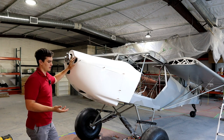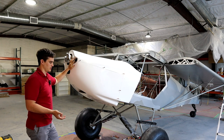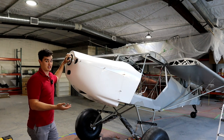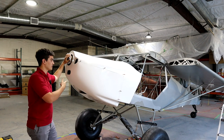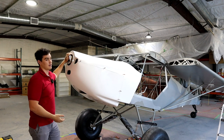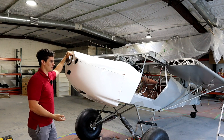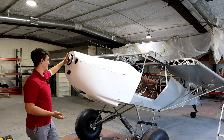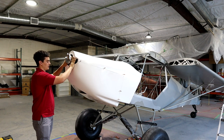Prop spacing is super important. This cowling is pretty much de facto designed for a two-inch prop spacer. I called Kitfox and asked if I needed one, and after research it's clear that with essentially every standard propeller, these cowlings are going to need a two-inch prop spacer. We made wooden block spacers to hold it in place for mock-up since I don't have the actual spacer yet.